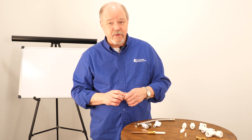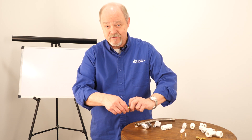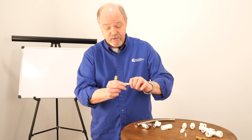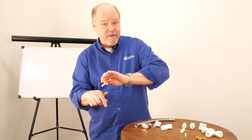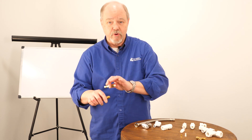If reassembly doesn't fix it, you may have to replace the fitting and the tubing right there. Usually when you compress these, that little sleeve is not going to come off the tubing anymore — because of the compression activity, it has actually deformed the end of the tubing. That's good because it helps make the seal, but if you have to take the fitting out, you're going to have to cut the sleeve off to go back together.